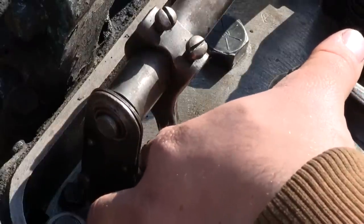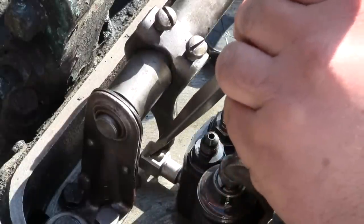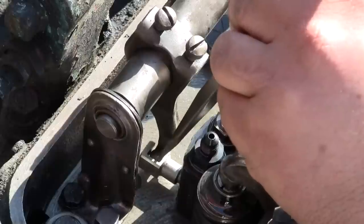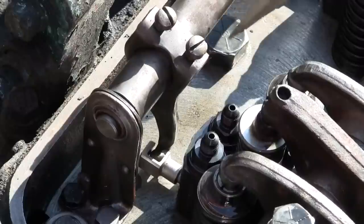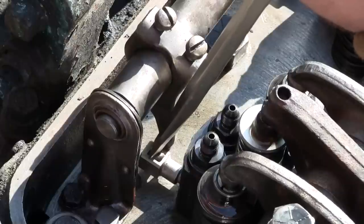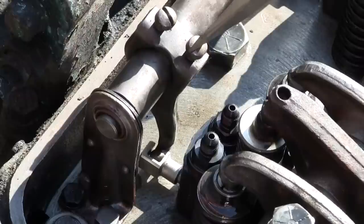It's almost tight, but not quite. So pretty much you want the ball of this lever lightly pressing up against the inside surface here, the surface nearest the rack, of this little C-shaped area. So in order to do that, I'm just going to adjust these screws ever so slightly. This screw here, when you tighten this one, it brings the tip of the lever closer to the injector body. I'm going to back this one out just a little bit first.